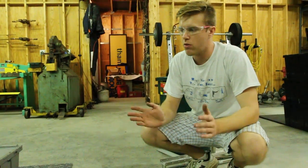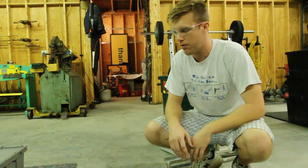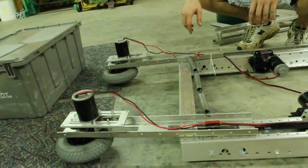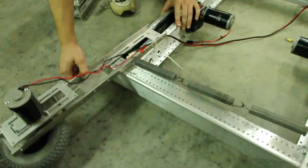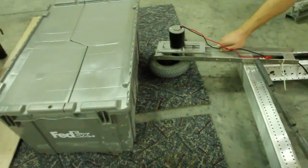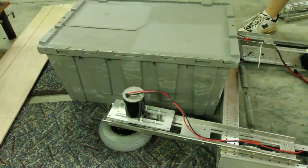It all comes down to quickly acquiring a certain orientation for your gripper to grab the tote. And that's where this guy came in. These are just two wheels spinning in towards each other — spring loaded on two large lever mechanisms. The principle is that as you drive in to the tote, these wheels are spinning at a rapid rate of speed and will draw the tote in.